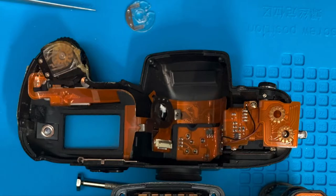This is the top plate off. These are those two screws I was talking about earlier. In order to get to the hot shoe and tighten the bracket, you're going to want to desolder these five points right here. Once you get rid of the solder there, you can peel back this part of the board. There are four screws underneath — you're going to want to tighten those. If you want to, you can use screw cement, which I believe is called Loctite. I don't have any around so I didn't use it, and we'll see how long that lasts. But if you really want to do this right, use some screw cement.